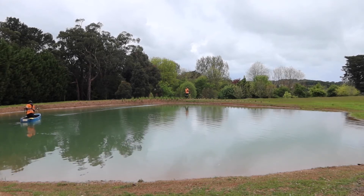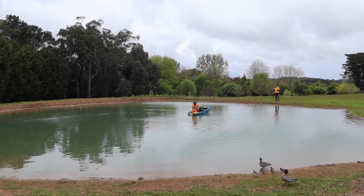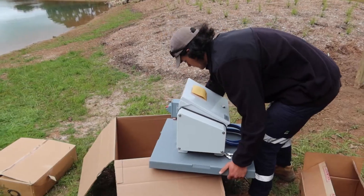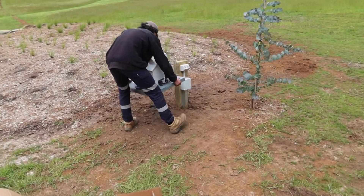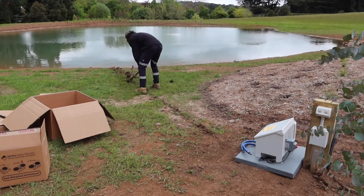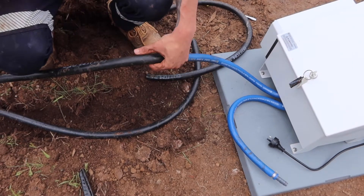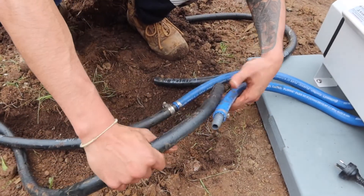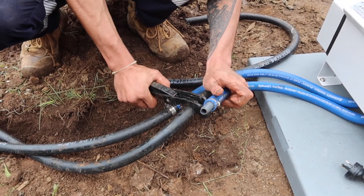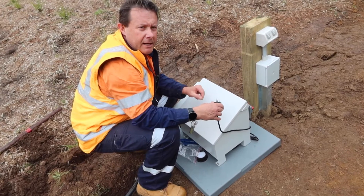On a small dam, with a boat and a long bit of rope you can pull your mate across — it's a lot easier as you have more control and can be more precise about where you drop the air station. These systems come on their own base which is very easy to install. Now we'll just dig a shallow trench to hide the hose — trenching it directly into the ground. There's no need to sleeve it in any other PVC, as long as it's deep enough that equipment can't reach it. The hose can be direct buried. For a remote system, the trench can be up to a couple of hundred meters back to the compressor, with a valve box dug in at the water's edge.